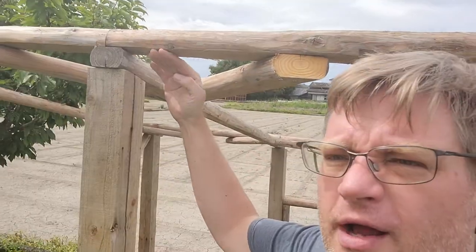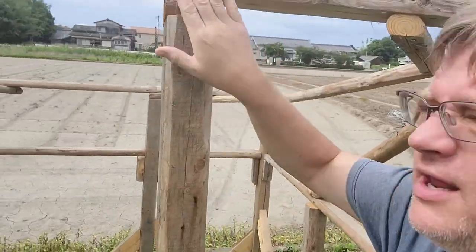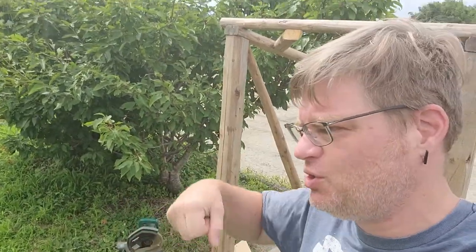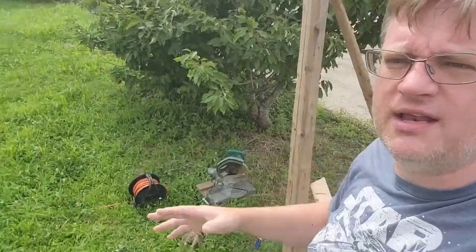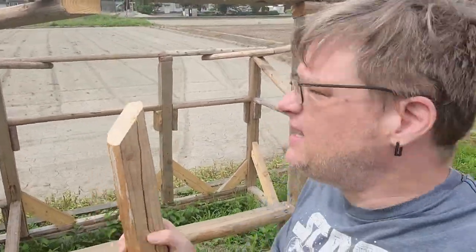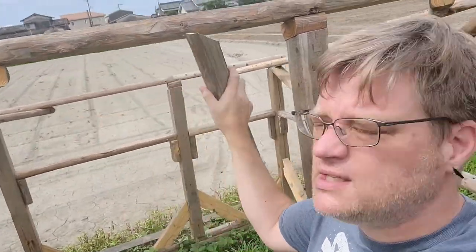What you didn't see was me coming out here, putting a ruler against this, putting a piece of wood up against this straight up and down, or not that spot because there's a piece of wood in the way, right here, drawing a line on it, going inside, getting a protractor from one of my kids that I use at school, measuring it to 11 degrees, setting that saw over to 11 degrees with the help of a wrench because that back thing was so stiff. At first I thought it didn't lean side to side. So setting it over to 11, setting it to 45, giving this a cut and seeing, did that work? Trying it on this side, realizing, no, that's the wrong way, it goes this way.